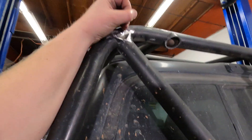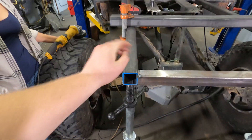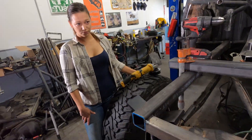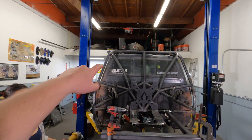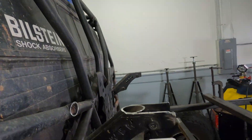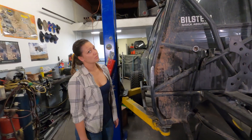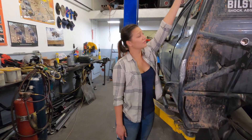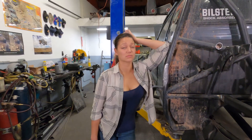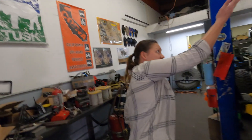Here, since this tube landed first and then this tube landed into it, I'll probably grind that down and fill-weld it. I made this back section 58 inches long but I think it'll only end up being about 54 — I wanted these to be too long instead of too short. So maybe mirror that length up top. Let's measure from right here all the way up to where the bottom of the two-by-two is going to land, cut a piece exactly that height, put it in at 90 degrees to this surface, and try to land it on that. Since this one is further forward it'll be longer, so we should make it like 60 and then trim it back to wherever flat is.